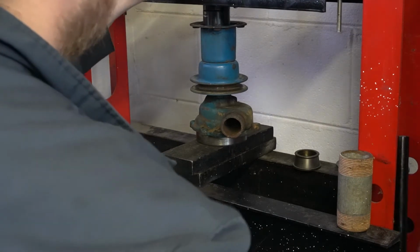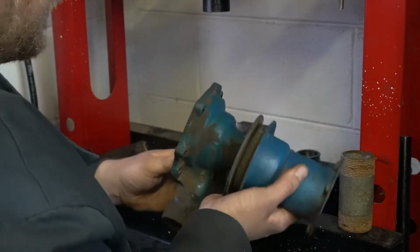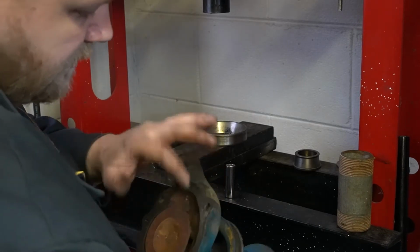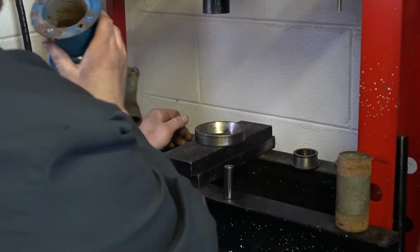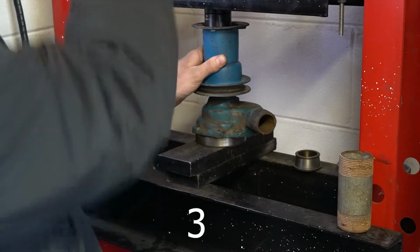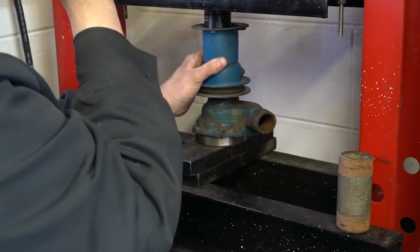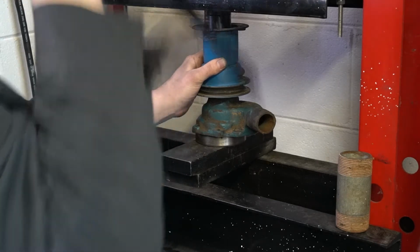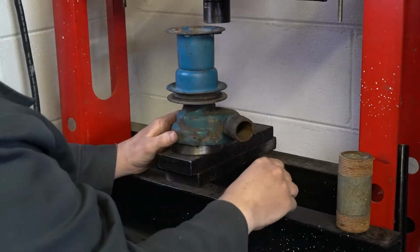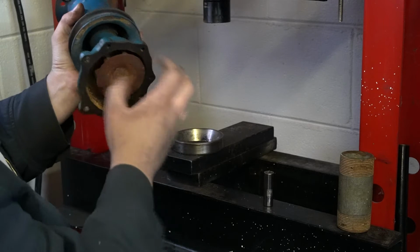And just go really slow. Like I say, these things are notorious for breaking doing it this way. I mean, you got to think you're pushing out the impeller, the seal, and the bearing all out of everything at one time. Okay, so there it was releasing. So now, let's see what happened. Did anything move? Did we break anything? Pulley still spins, so that's good. Our impeller is now down from our mounting flange, which means that this assembly has now broke free.